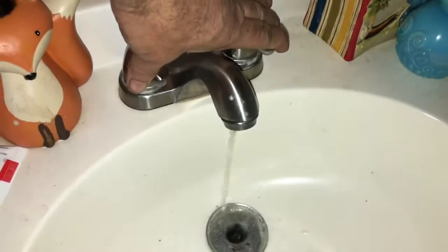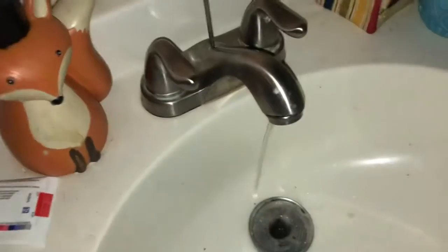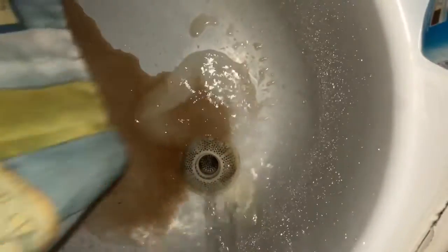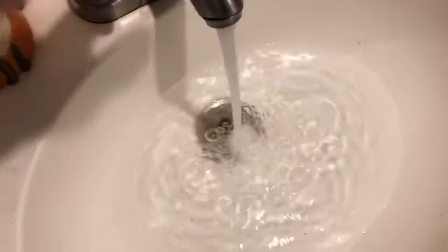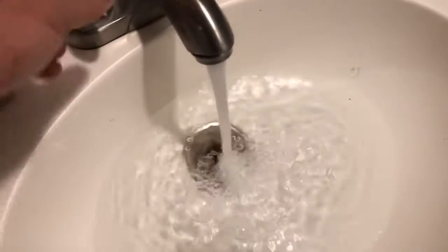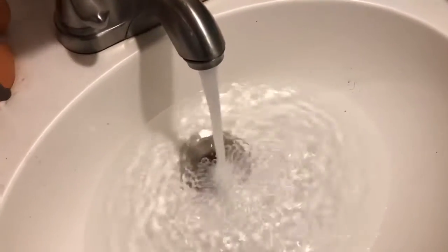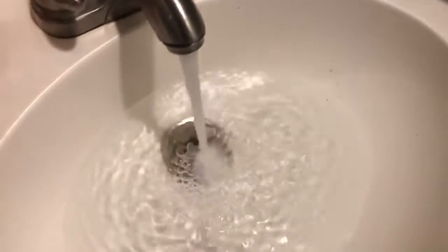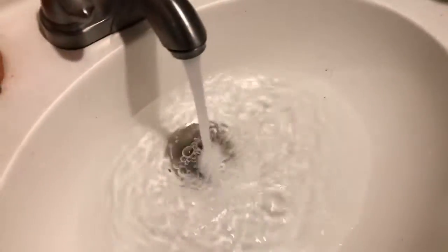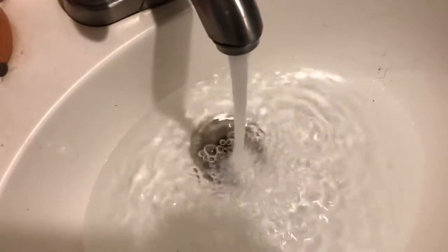You want to make sure your valves are open because you don't want any air in the system. Rusty water, gross. All the air in the lines has to go somewhere. So you open this up, cold is on, working. You can open both of them up if you want, but it's best to fill up the tank quickly. Just run your hot water and fill that tank up. But when it stops bubbling and gurgling, it's full. And you can turn on the power, the juice.